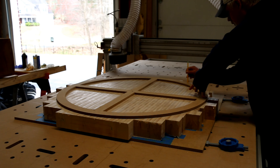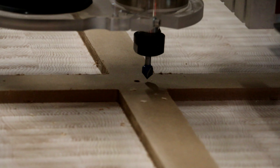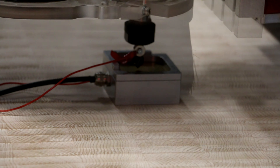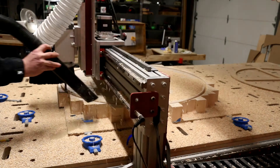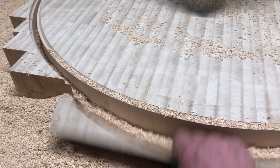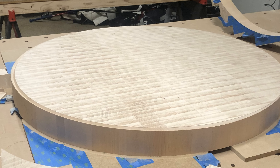Once the top was flattened I needed again to find the center. Then I could make a chamfer pass around the entire perimeter and, using a six-inch end mill, finally the full depth profile cut. The way I fastened the blank seemed to work. There was a mistake in the profile which cut the circle about a quarter of an inch off, which ruined the chamfer, but I had designed an extra quarter inch of height to give me some room for error. I ended up just resurfacing the top down and recutting the chamfer.